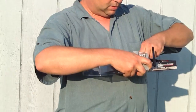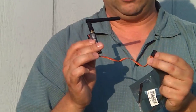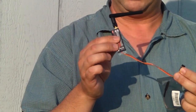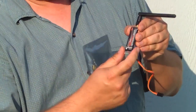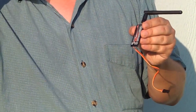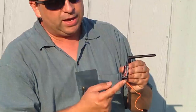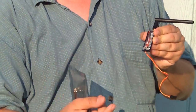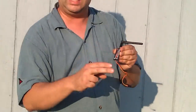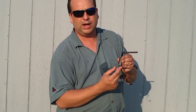The transmitter is right here. This is the accessory plug-in — it looks like a cable that goes to a receiver, but it actually goes to the extra unit that monitors temperature. A number of people have asked online whether this requires another channel on the radio, and it does not. You plug your battery's balancing port right into this connector here — so you've got your two main leads, and then that small balancing port hooks right on here, up to six cells.